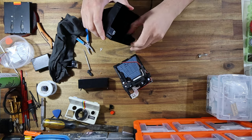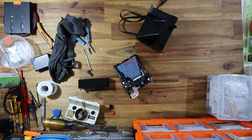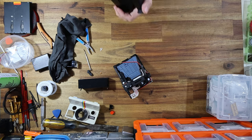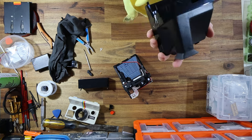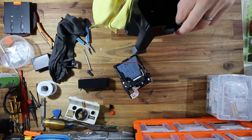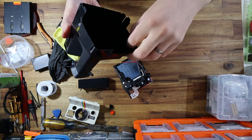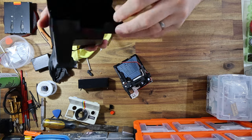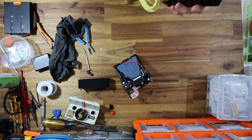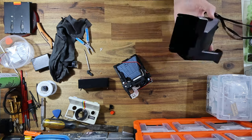In the body there are two springs — it's a little hard to see in the shadows — but what these springs do is prevent you from inserting the wrong pack of film. They don't do anything essential, and we aren't going to be using them because we want to be able to put any type of film we want. So we're just going to remove them and dust the insides. Even the little glass window for the film counter is spotless. Really a nice example — so thank you Tony for sending this to me. It was very nice to meet you in Amsterdam.